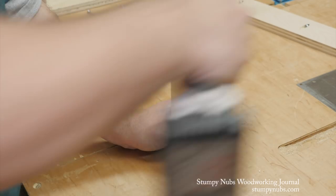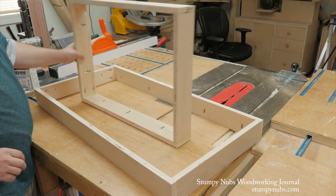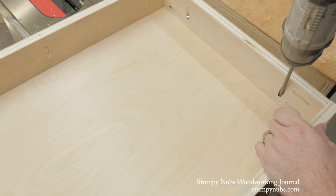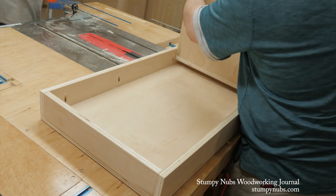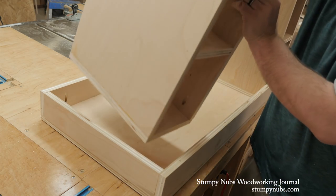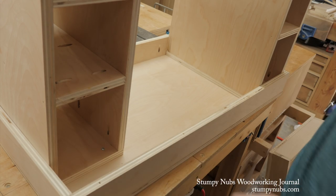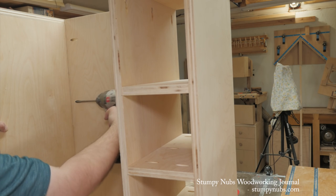The pocket screws really started to pay off when I began assembling the frames for the top two sections of the stand. By boring pocket holes all the way around the inside perimeter, I have a way to easily attach the top panels without the screws showing. The columns are attached to the underside of the top assembly using screws as well. This means the weight of the lathe is transferred through the top and down the side panels of these columns, so none of the interior joinery is weight-bearing. This means the stand will support a ton of weight. The addition of a center panel also helps oppose racking forces, so you're covered in all directions.